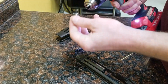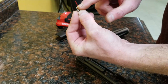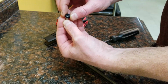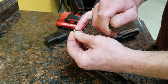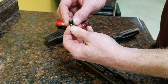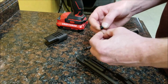And you can also do the same to the stem, well, the pin rather, and that just prevents friction when it moves in and out of the seat, because these are turned on a lathe, and often you'll have machine marks going around it, and you can feel it grab in there if you haven't cleaned it up, or if it's got a subpar finish on it from the factory already.